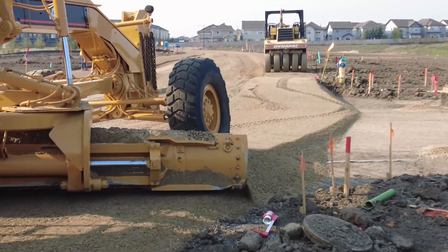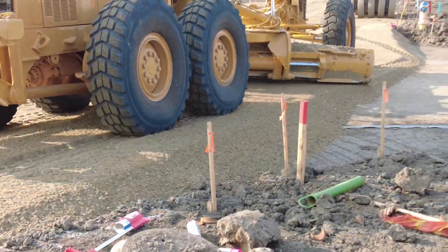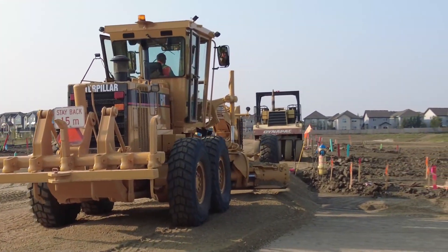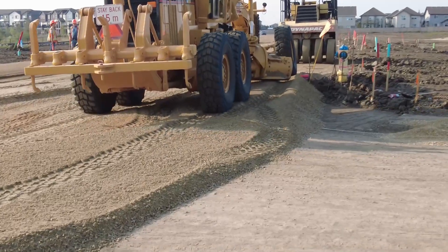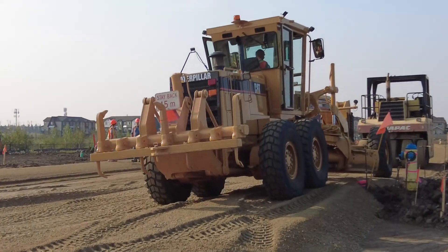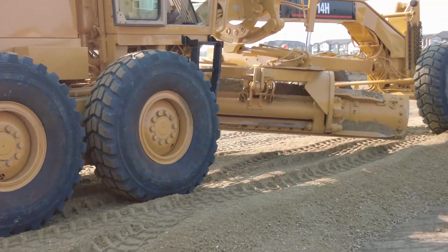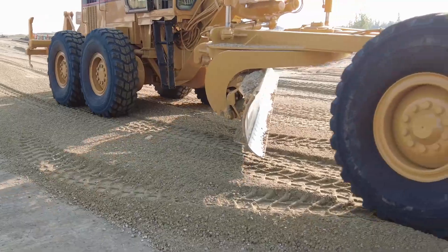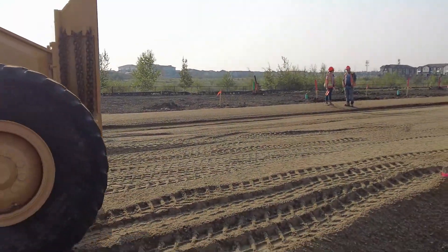After a while you can just guesstimate that two percent — it works better than using your slope meter. In the last several years I don't even look at it when I'm working on these berms. I've gotten to know the feel and the look of what that two percent looks like, and I can guess it pretty close. Right now my slope meter would probably read six percent, and yet the top of the berm is approximately two percent. It's just another place where slope meters are not so useful.